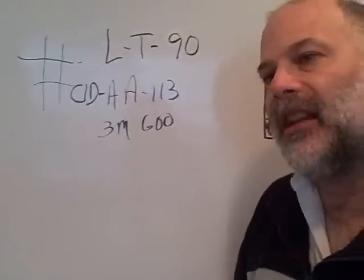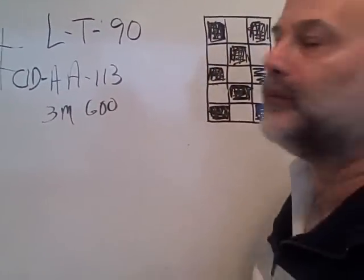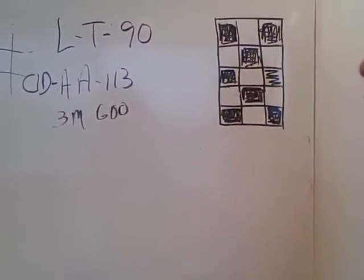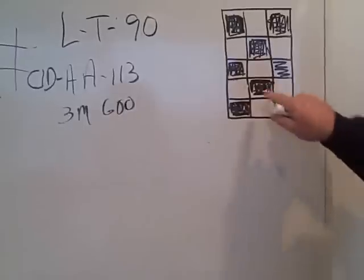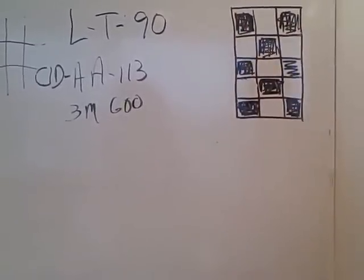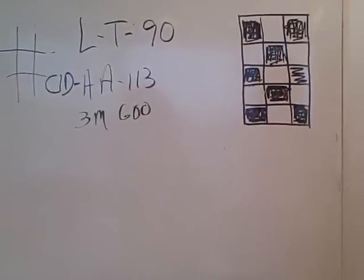The IPC committees went a little bit further, specifically in the area of solder mask testing, to include a standardized pattern to remove the bodybuilder/90-pound weakling controversy. They created a crosshatch pattern that is actually built into the coupon — a checkerboard pattern where the black squares would be copper and the white squares would be laminate material. You put your solder mask over that and didn't have to go through and cut it. You would have complete coverage and could lay your strip of tape over here and pull it off.